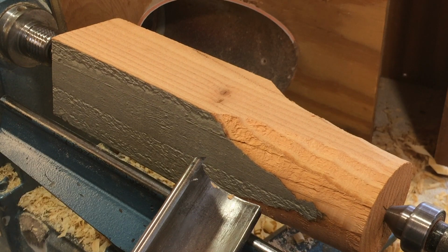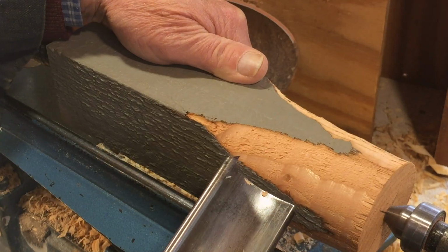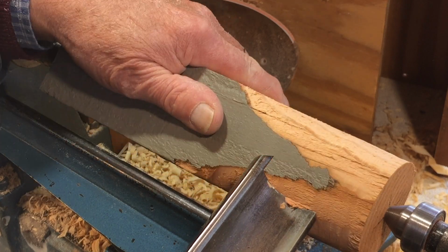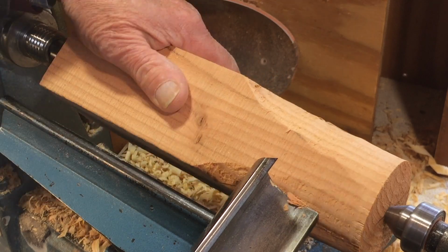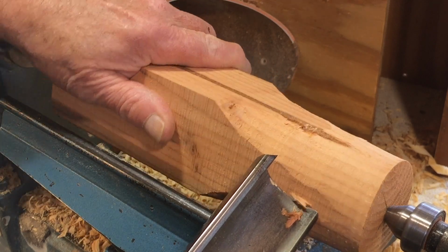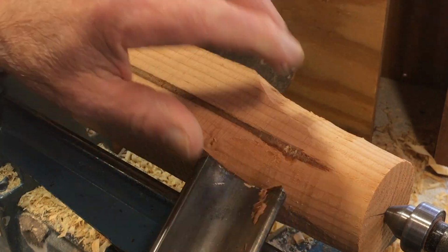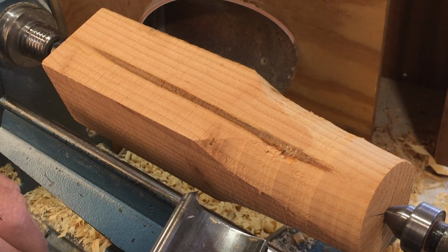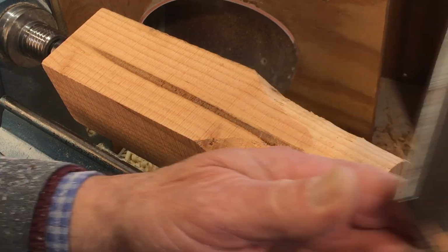take you back. Now the surface is not going to be particularly good because this tool is essentially peeling. It's taking a layer or taking individual fibres off the bundle, if you like. It's not a slicing cut. So you don't worry too much about that. That's the deep fluted 2-inch gouge.